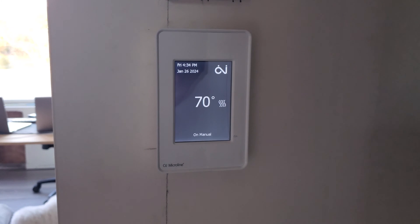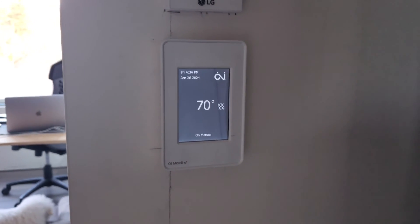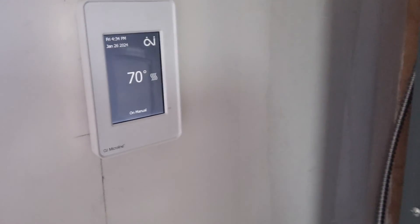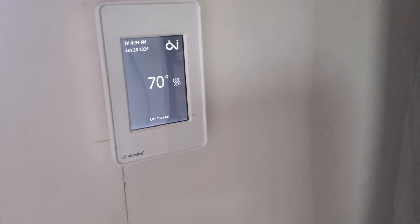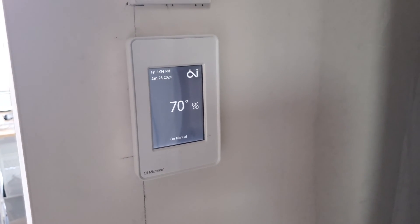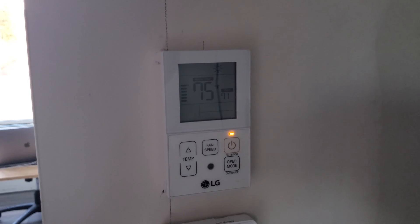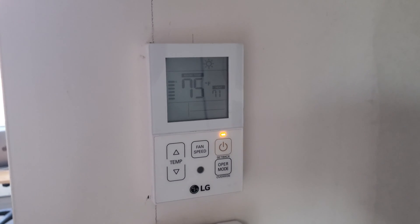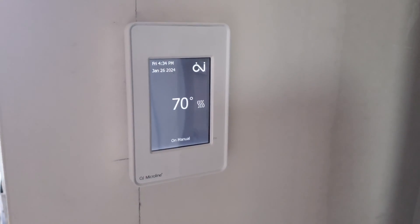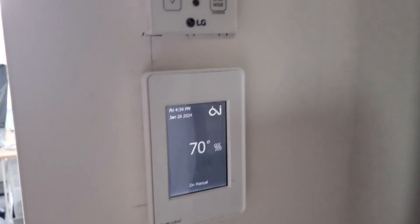About 30 minutes ago it's warmed up one degree. We'll see what set point we want for radiant — sometimes your floor temperature has to be a little warmer than what you'd set for your actual ambient temperature. We've got this other thermostat right above it, which is the thermostat for the mini split, so we'll have these two thermostats next to each other and see what happens.